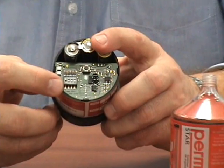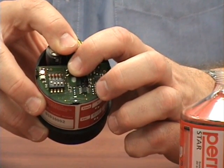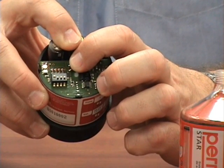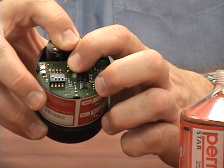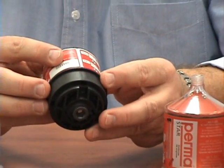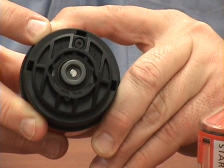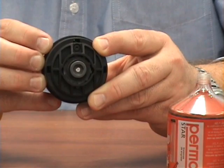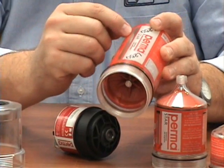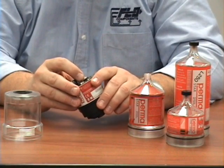Those dip switches are located on top of the circuit board, which you can see right here. Upon activation you will see one light come on — there are two LED lights, a red and a green, giving you indication as well as troubleshooting for unit operation, reservoir run dry, and low or high pressure. When you activate this unit it will run for approximately 45 seconds right from the start. As this unit slowly turns, it is threading the piston down through your reservoir, dispensing the lubricant. The nice thing about the electromechanical drive units is that it takes the ambient temperature factor out of the picture.